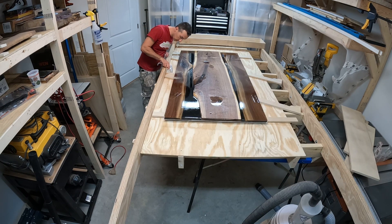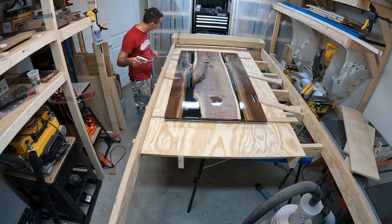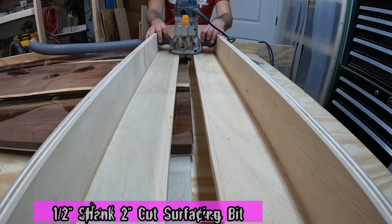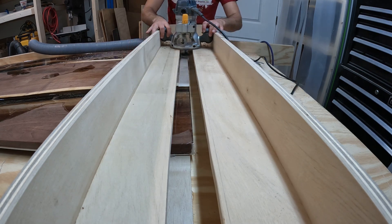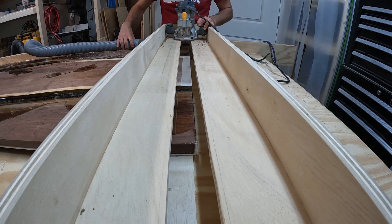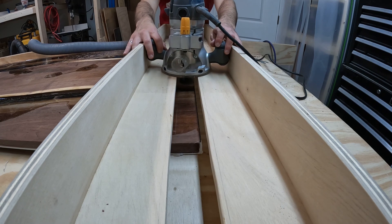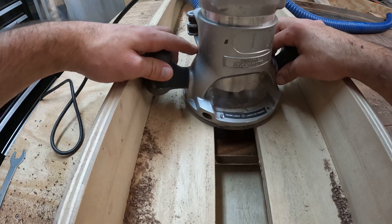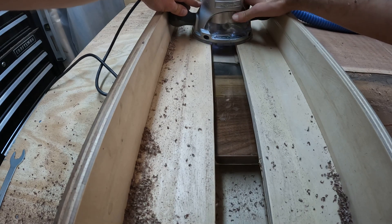If you thought we had enough flattening in the first round — nope, got to start that all over again. Get the desktop on the flattening table (check out my other videos for a build on that), get everything glued down so the table and desk are together and parallel for a good flat surface. I had left the middle slab a little bit tall compared to the outboard slabs.